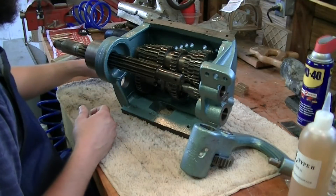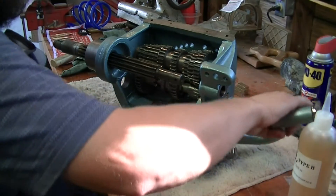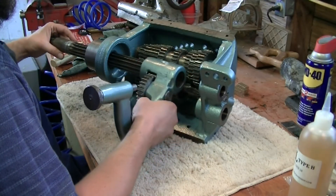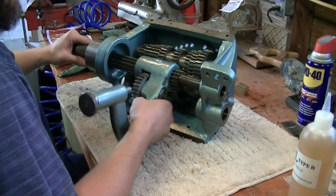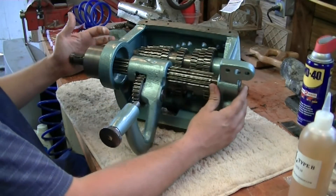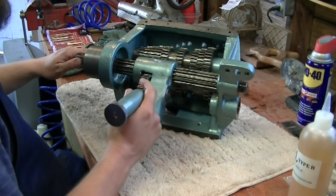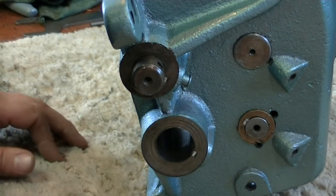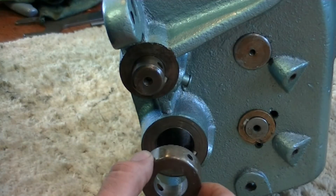The shaft here was of course the one that I had to repair — took a stone tube and ground it down a little bit. That fits really, really good. Look at that — no hammer, no hammer, just goes right on there. That's the way it was supposed to come off. So on the end of that shaft we've got a ring and a tapered pin to hold it in place.